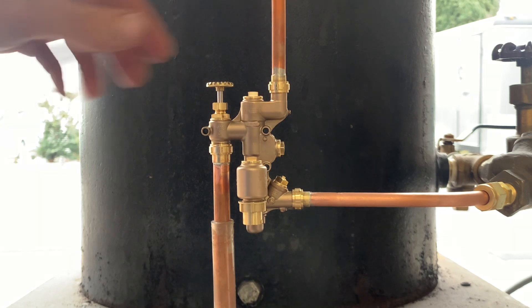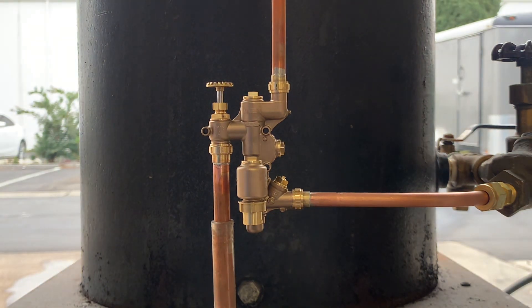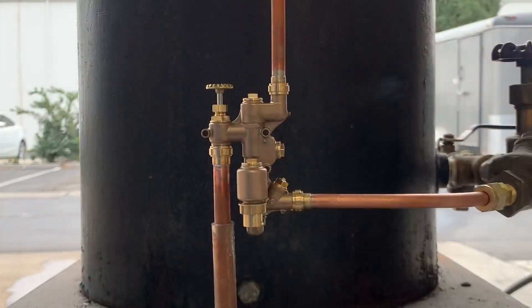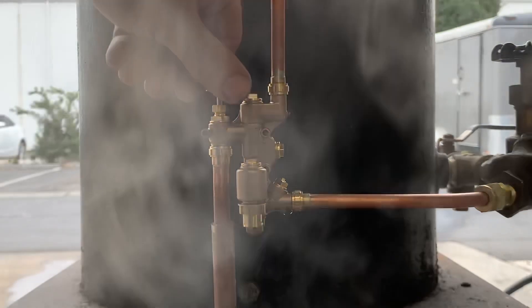I want to show you some things on this. We're at about 150 psi. Even though this is a non-lifting injector, it can still lift. I don't recommend installing these high up in a lifting position because people will probably make fun of you. But because it still has that lifting design, it'll be super reliable when it's down below the cab and if something interrupts it, it can pretty easily restart.